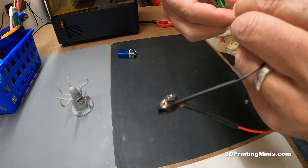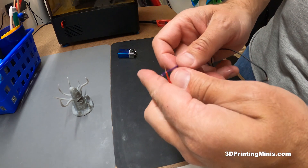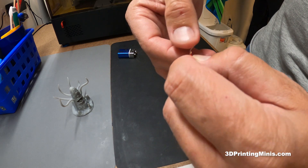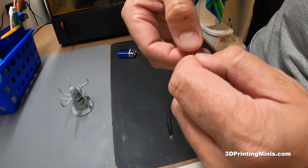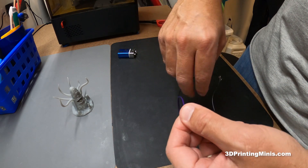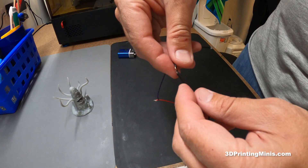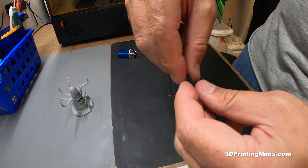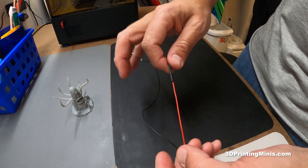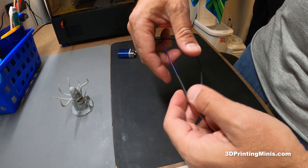Wrap this up and mush it together, then I'll do the same thing for the red and purple. The black wire is black and the colored wires should be two reds, but it's red and purple — I think they use purple to make the light side look snazzier because it's a purple hue UV light. There we go, got these together. I'm gonna slide the tubing up over here. You could also use electrical tape if you have it — it's a little more readily available. But if you have this tubing, just slide it over your connection.